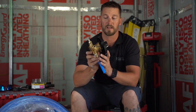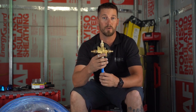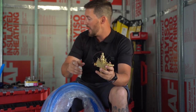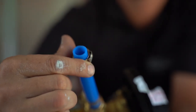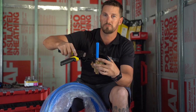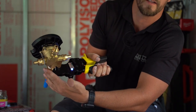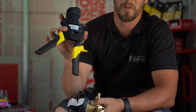My cold will come in from the left hand side, so my cold is going to come in here and my hot is going to come in here, and then this is going up to my shower. When we're building this and we don't have a tub spout, all we have to do is make it look like the tub spout is closed all the time. I'm going to install one of these on the bottom and then put this little cap on here. Then I would take one of these crimp rings, slide it down, and take my tool — this is probably the most expensive part of the system, costs about 60 bucks — and we just connect it on like so.